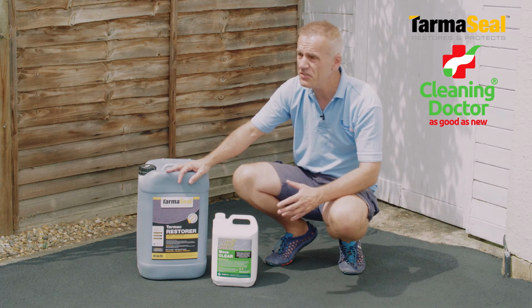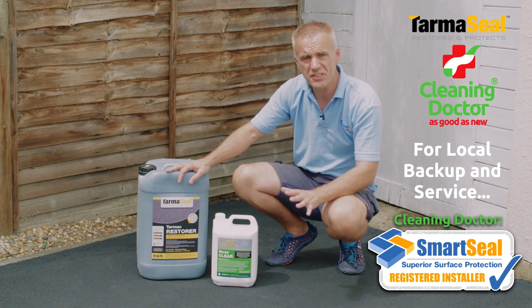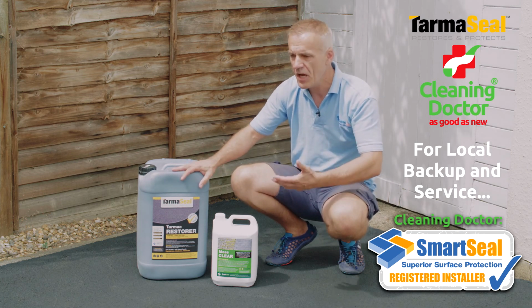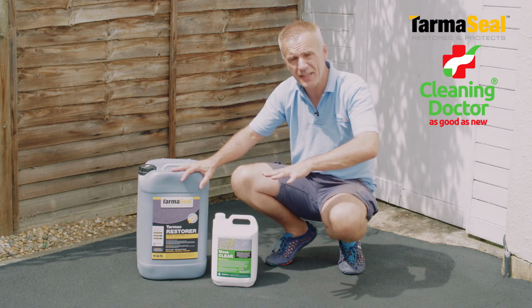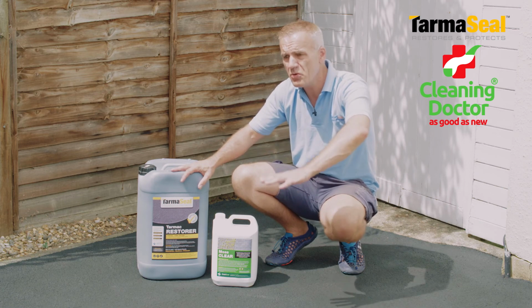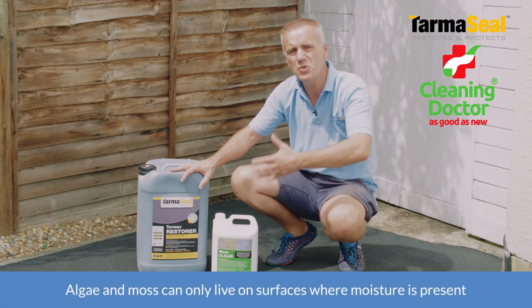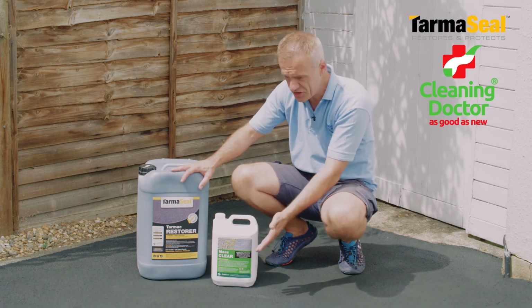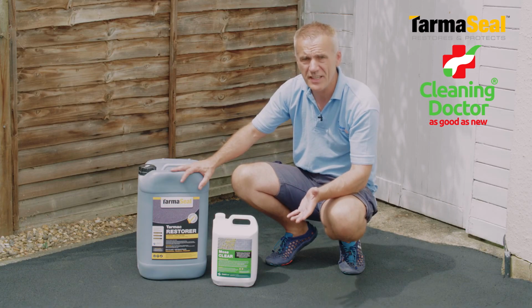The other thing to consider, if you've got maybe north facing or overhanging trees and the area doesn't receive much sunlight, then you could find that you still have areas that go green. And that would be because with the product itself, it's putting that water repellency back into the tarmac, okay? And those algae will only grow where you have got a water resistant surface. So if you did find that the area still goes a little bit green during the winter, you can always just very simply take a product such as this one, a moss and algae clear product, dilute it down to maybe a 1:5 or even a 1:6 ratio.